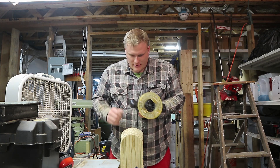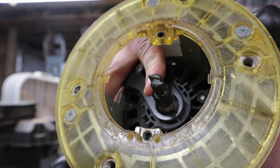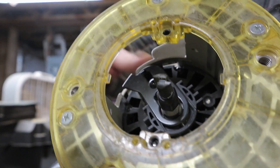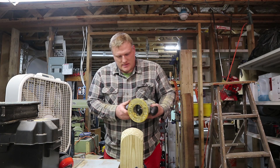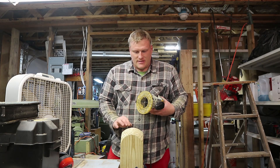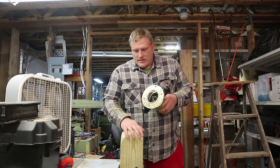I'll bring the camera closer so you can see it. Let's unplug this for safety. I used a normal router bit that has no center — that doesn't really matter in this case because the arc goes into that middle point anyway. It might actually be better because most of your cutting is being done at a radius other than zero. I had to adjust the depth only three times: once to knock the corners off, second time to rough out the round, and the third time to get it at the right depth. I got lucky — it was close but going a little too deep, so I had to move the base out away from the bit to decrease aggressiveness, and that allowed it to smooth out.